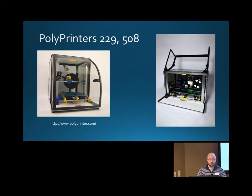You see a lot of the pieces on the printer are blue, yellow, or black — a lot of that is 3D printed, and not at the highest infill rate. A lot of people online recommend 100% infill for everything, but that's not really necessary. A lot of the parts we use are 20 to 25% infill, and that seems to be reasonable. When they wear out, they wear out, though it's not very common for as much as they're used.